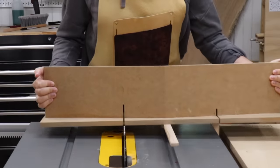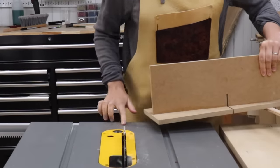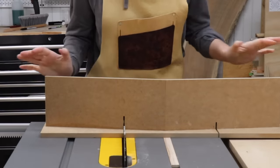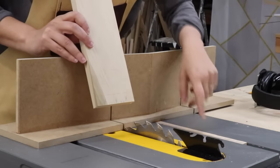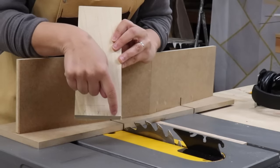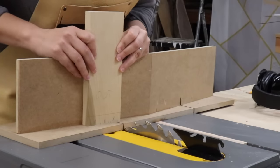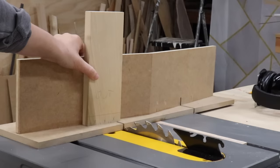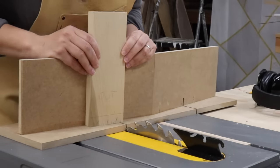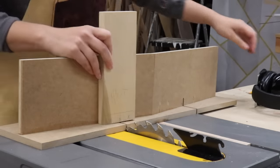This is the pin jig. The reason I made it shorter and split into two separate jigs is because the distance in front of my jobsite table saw is really only about 6 inches. If you have a full-size saw with more space, I'd totally recommend making it one jig. When the jig is in the left-hand miter slot, looking down at the piece, you want to line up on the right-hand side of your cut line. I'm cutting out the waste marked with an X, so I line up the blade on the right-hand side when looking down — which appears as the left-hand side on camera, so don't get confused. I'll make cuts on all three marks at the same time, then switch the jig to the right-hand miter slot and do the same thing.